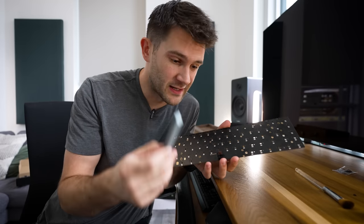And then it was time to install the 75 or so individual key switches. I should point out that a number of my switches actually came with bent pins, so make sure you check each switch before plugging it in. It might just save you tearing down your board later when one of your keys doesn't function right.